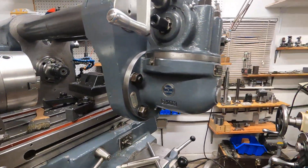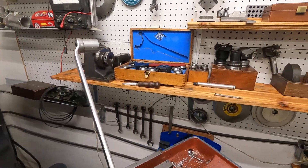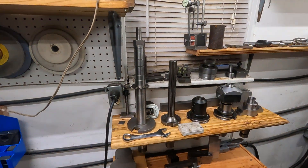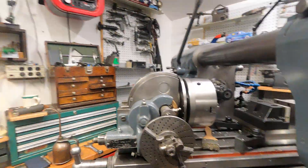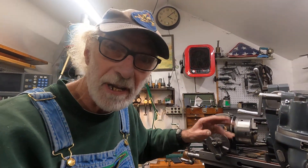The cutter grinder is great for the horizontal wheel cutters and such, and we'll be getting into that. Over here I've got the collets for that and some other attachments. That's the 40-taper stuff for the sliding vertical head attachment, which is driven by that spline right there in the middle. It can be replaced with a horizontal arbor — the machine uses as a horizontal milling machine, leaving this right where it is. This is kind of an early, weird version of a Rangemaster sliding head mill. They made this for a very short time during the war, thought it was an improved product — and the sliding head mill is a great improvement. This works great, but it's got some hitches.